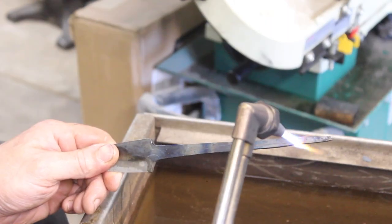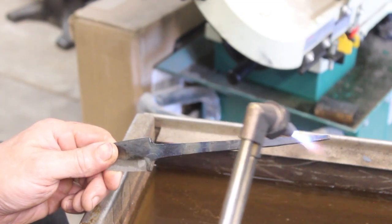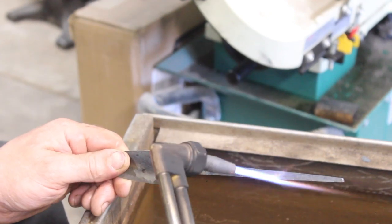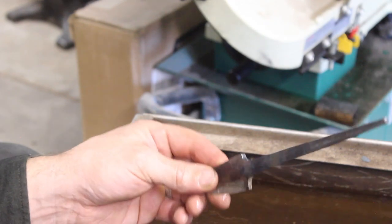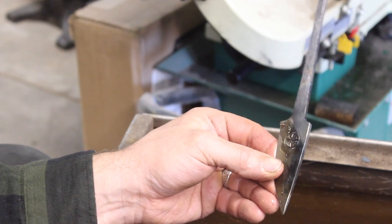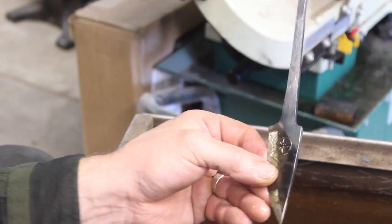That is the purpose of differential tempering, which is what we're doing here. I'm going to temper out the tang completely so that at a later point we can work with it at the end of the handle. I'll actually spheritize the end of this tang eventually so that I can peen it over on the end cap of the knife. But for now, a fully tempered-out tang will be adequate, and then this blade is ready for final grinding, polishing, and then a handle.